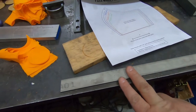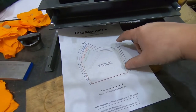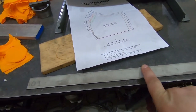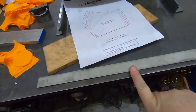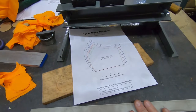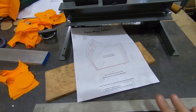So we're going to start with this. I need to first cut it into some rough lengths. There are two straight edges, so I can do those exactly, and then I'll just overcut for the rounded ones. Then I'm going to put them in the mill and cut the bevel, the cutting bevel, on the top side. I will have to nod the head of the mill to do that, but I can tram it. It's not actually that big a deal. Then I will get out the induction heater, and start working in those curves, which are pretty simple. I don't think that'll take too long. And then I can weld them together.